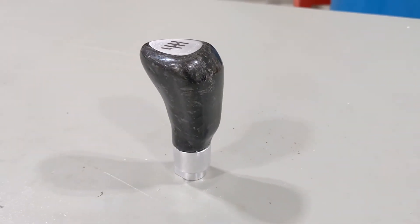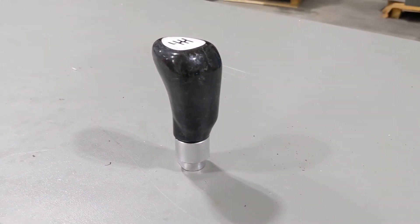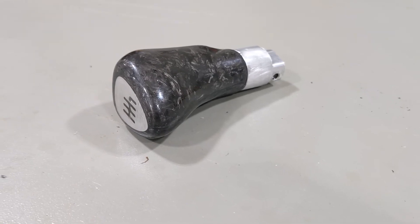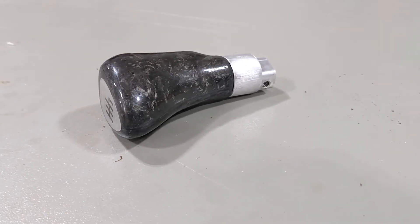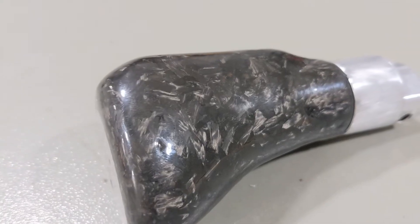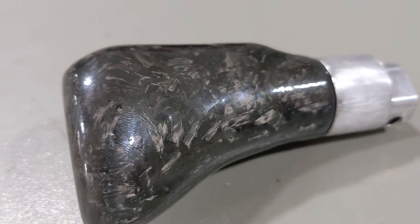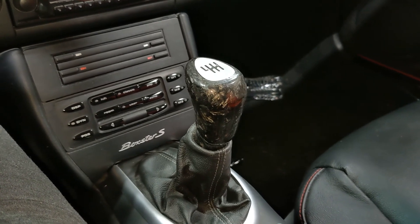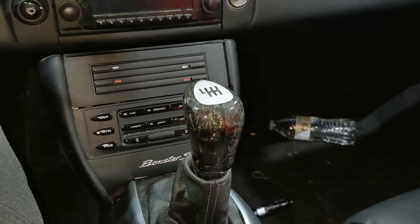So I think I've pretty well answered the question: can you make carbon fiber parts at home? The answer is yes. My part came out pretty good, especially being a more complicated part like this shift knob with a core and a couple of composite pieces that aren't carbon fiber. I'm pretty impressed with how this turned out for doing it at home with a 3D printed mold. Would I do it again? I don't know that the answer is yes — it's a pain to do, it's really messy, and the post-processing is a lot of work that frankly I'm not good at or really patient enough for. So whether you want to take this on yourself is up to you.